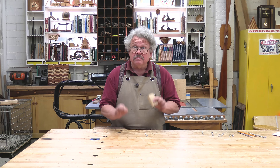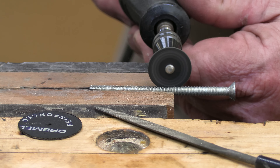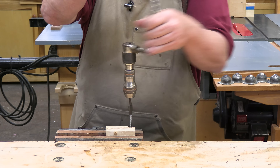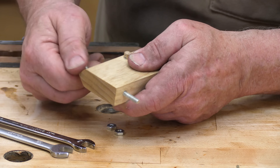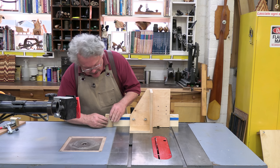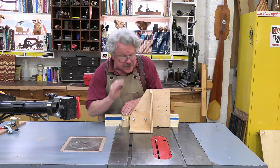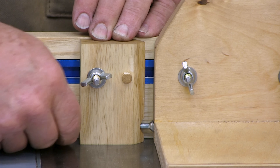So you have to make your own tap. Cut or file a groove down the length of another flathead machine screw the same size and pitch as the one you're going to use in the stop. This turns the threads into teeth and makes the screw into a tap. Drill a hole through the stop slightly smaller than the screw, and then turn the tap you made into the stop — the teeth will cut the threads. Turn the tap in and out several times to loosen the fit of the screw. Then turn the real screw into the hole and tighten two jam nuts on the end to serve as a knob to turn the screw head. Install the stop in the miter gauge extension and put the screw head right up against the tenoning jig. Tighten it down, loosen the tenoning jig, and now you can adjust its position with excruciating precision — just use the slot in the screw to count your rotations, half rotations, or quarter rotations.